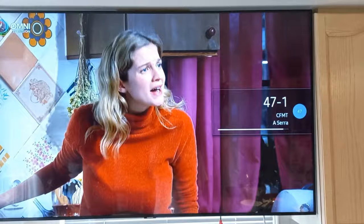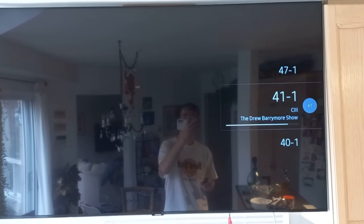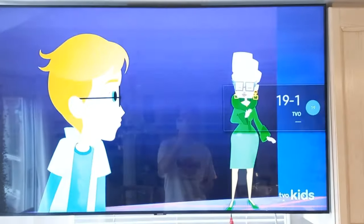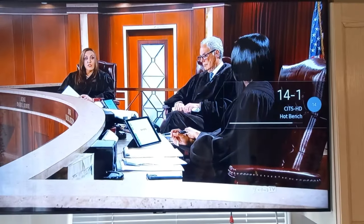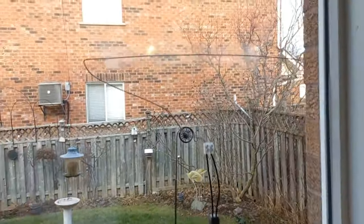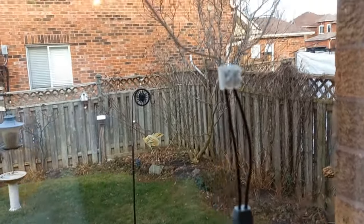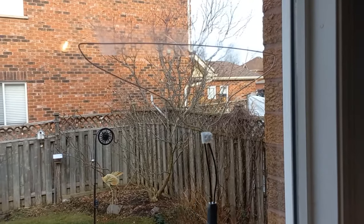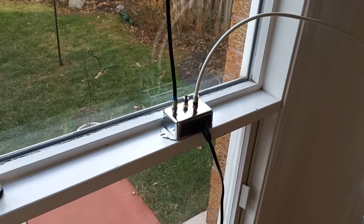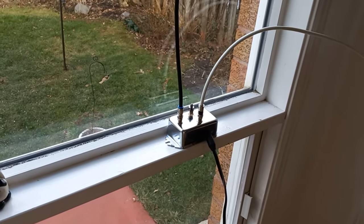Let's take a look again - how many channels do we got on here? Forty. This is totally free TV. So there you go guys, I hope you enjoyed that and find it useful. You don't have to make all these crazy gimmicky things that people make videos about. You can just do it with a coat hanger, but it's a good idea to have the balun, because that impedance matches the antenna to the transmission line. Then you can also put amplifiers and things in because it's all the same connectors, right to your TV. So there you go guys, have a good one.